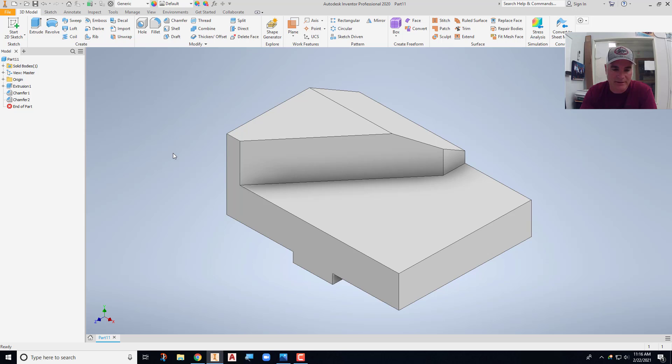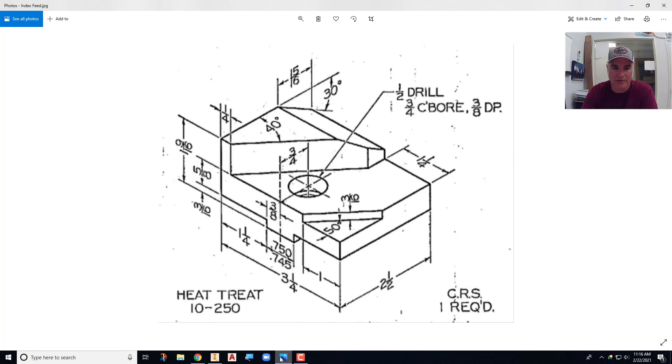Comparing to the picture, you can see they're very much the same. The final chamfer is this front chamfer — it has a distance of one inch and an angle of fifty degrees, but it's only a partial chamfer, three-sixteenths. Getting this chamfer placed exactly where we want it can be a little frustrating, so you have to play with it a little bit.